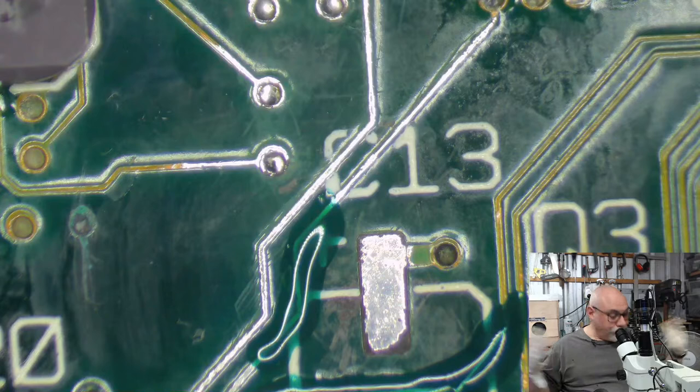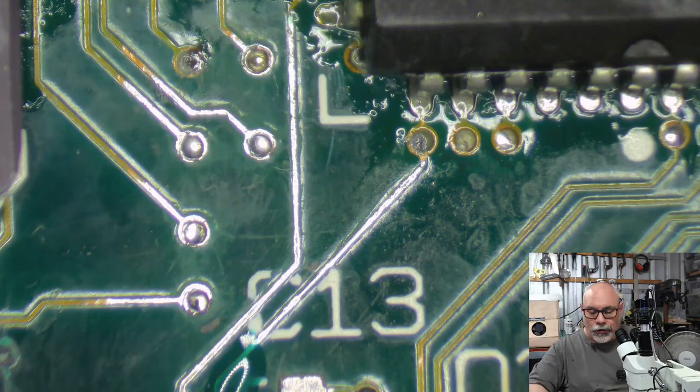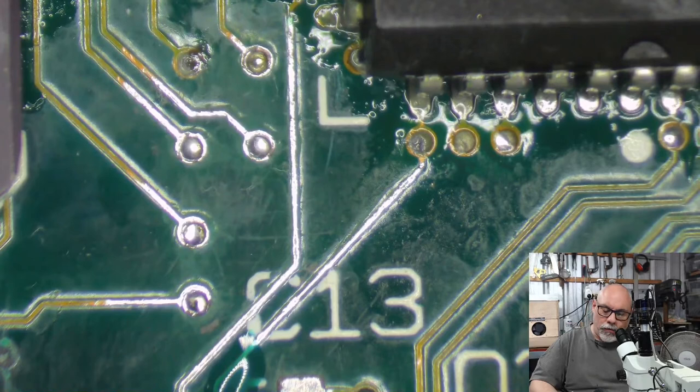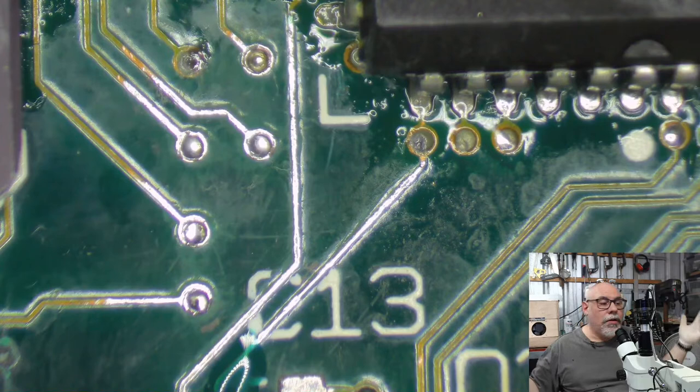And I do actually have something on my Recap-A-Mac website in the frequently asked questions that goes into this a little bit. And I think one of the most important things to remember is that if you look at, say, the Quadra 700 or the Quadra 900, they use tantalum caps for that. Apple use tantalum caps for that. Whatever the reason might be, budgetary, reliability, who knows what reason they gave.